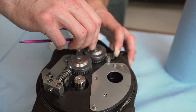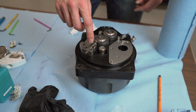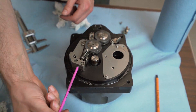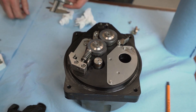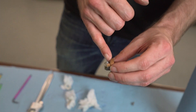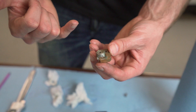You can use the clamp piece to grip the gear so that you can torque down on the gears. You don't need to wrench on it. Now that that's back in, we can reset our spring to a little over 21 millimeters. With the contactor — this has been cleaned, but you can see I broke this and this part needs to be replaced. Luckily the other side is what makes contact, so we're pushing through for right now.